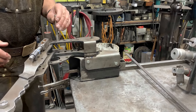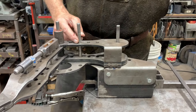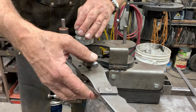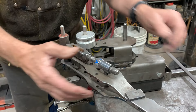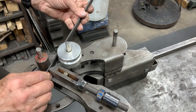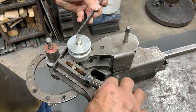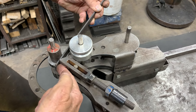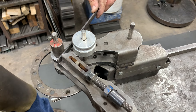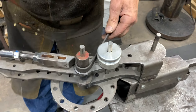I'm going to set that in the center. Oftentimes when you're doing draw bending you want to put another pin or cylinder at the end so that the part will move smoothly through the bender as you do the operation. I'll back this off a little bit to sneak that in. I really don't care about length right now — I just want to put in at least the initial bend. I'll tighten up the bending element and it'll push against the material, then I'm going to go ahead and make about a 150-degree bend.